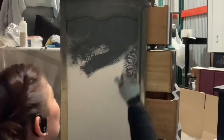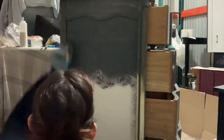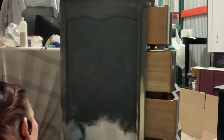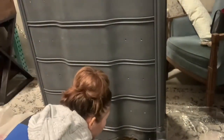Just coat the whole piece. You do have to work the paint into the wallpaper quite a bit — you can see me doing some swirling motions here. This is going to take the longest just because it's so textured. You have to work it in every which direction, and also make sure that when you're painting, you're looking at it from different directions, because sometimes you think you're finished and you'll see it from a different angle and you're not.